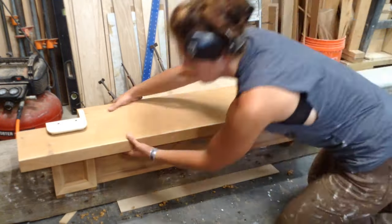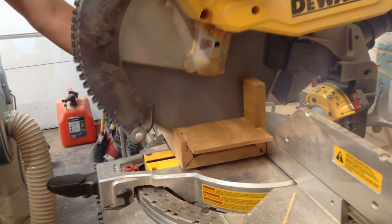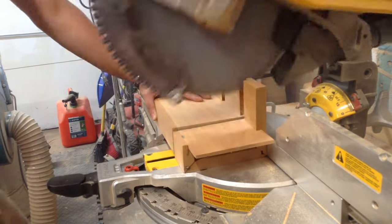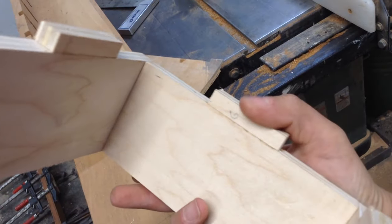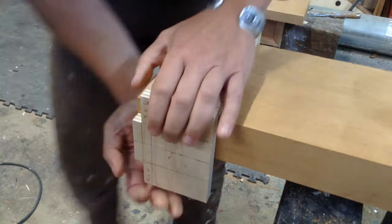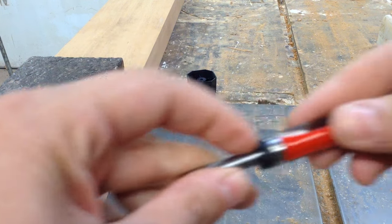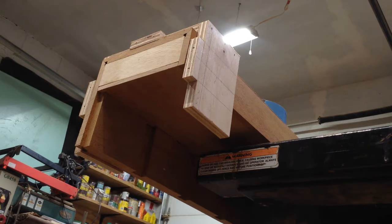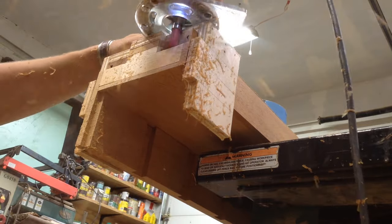At this point I had installed the built-in, so I set up a piece of lumber I could attach all this to and work on it. It also made it a little lower to the ground so I didn't need to use a ladder as much. Once I had the cornice made I could start measuring and cutting the pilasters. I made a simple jig out of half-inch plywood to create three tenons at the top of each pilaster, and I'll put three mortises on the underside of the cornice — that's how I'm going to attach them. I'm using a flush-cut bit with a bearing on top; the bearing follows my plywood jig and cuts out all of the excess.